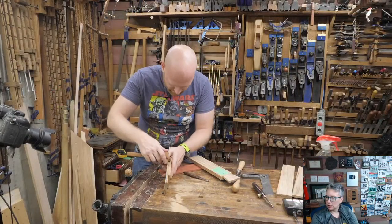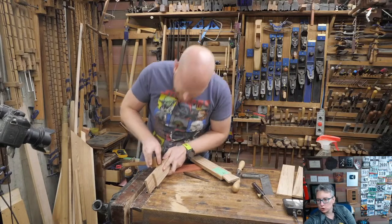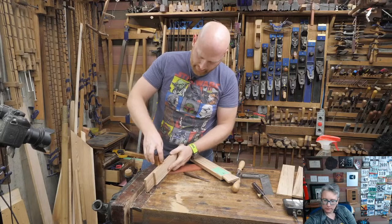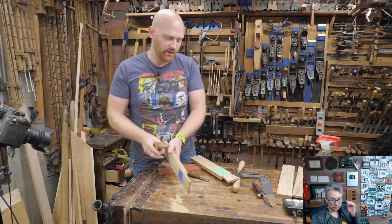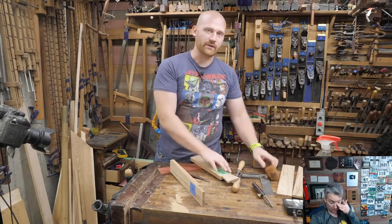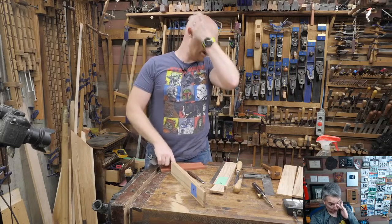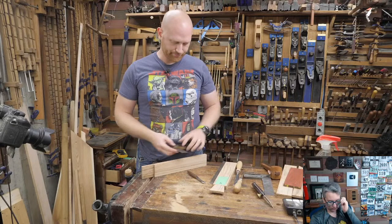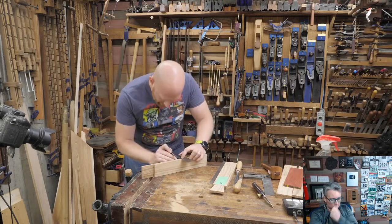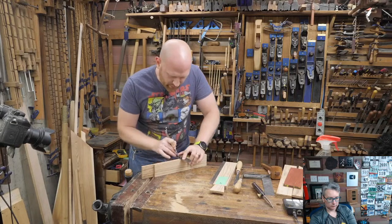Let's see. Michael C. asks, I'm making a potting bench out of white oak. What would be a good exterior finish? You know, there are a lot of debates about that, but it doesn't matter what finish you're doing. You're going to have to redo it regularly. So a really good marine grade varnish, every year, every other year, maybe 3 years, depending upon sun. But if you go with something light, like a boiled linseed oil finish, you're probably gonna redo it every 6 months or so.